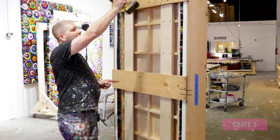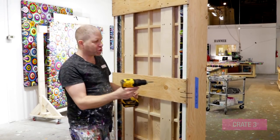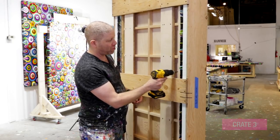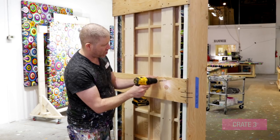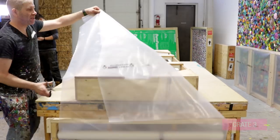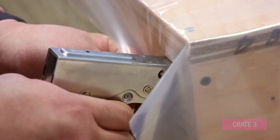You've got your piece, it can go straight onto your back slats. From underneath, you drill — and this time you can drill right into your frame or onto your bumper. This is the benefit of this system versus the other. With the other system, you have a completely covered back and can't see what's on the other side. When you're drilling blind, you risk ruining your painting. Here, I can easily see that I've got this huge chunk and I don't even have to measure — I can just start drilling. Instead of a full top, you can just put a couple more slats of three-quarter-inch plywood right on top. And if you're in a dusty environment, you can wrap it with something called super six — a nice thick plastic — and just staple the sides. That's your viewing crate.